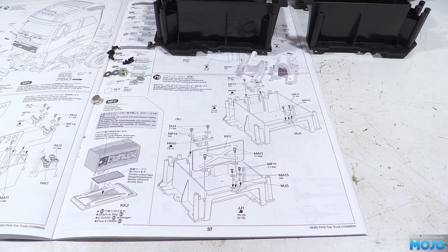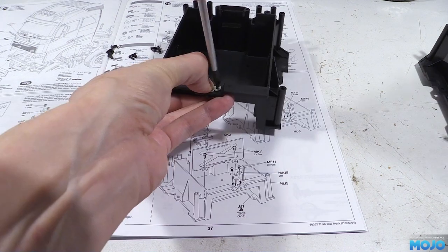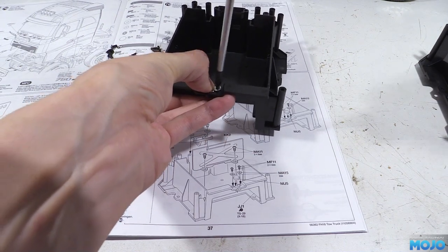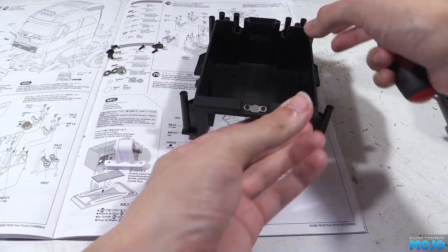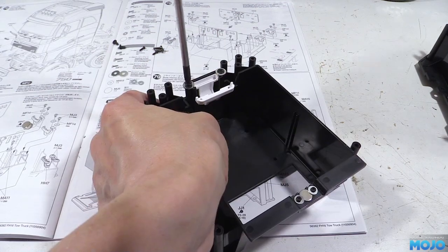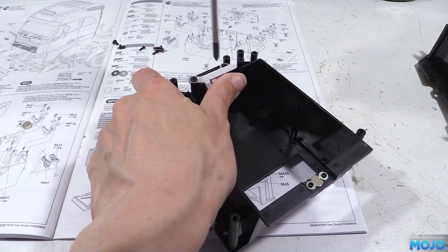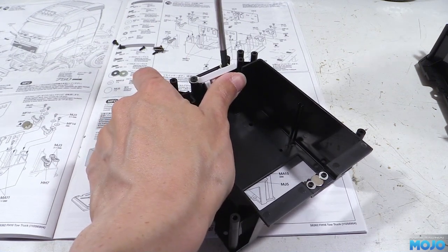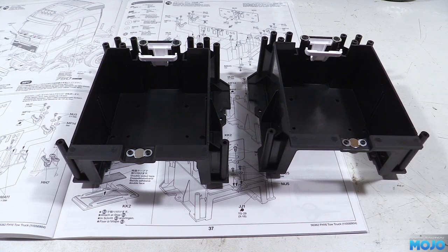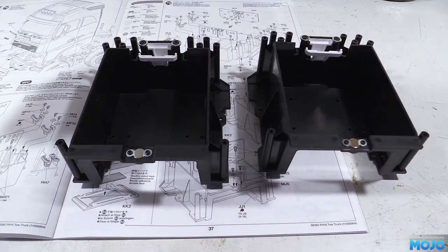Most of this is roughly the same as the middle boxes. The magnets have a pocket that they sit in and we use two of the 2x6 self-tappers with the small washers to hold them in. At the top we drop in a hinge and use the low profile screws and large washers. Other than the MFC shelf the two assemblies are the same — we're going to fit the shelf later when we can run the wires. We'll need to put the two 3x8 self-tappers off to the side with the shelf.